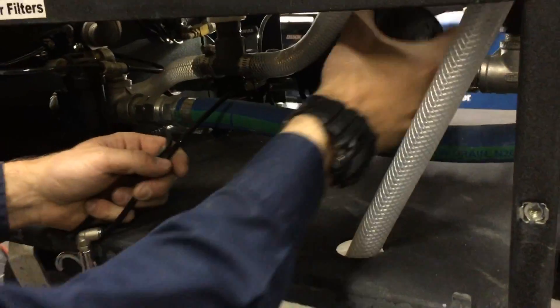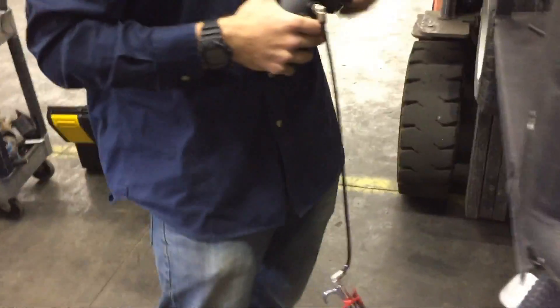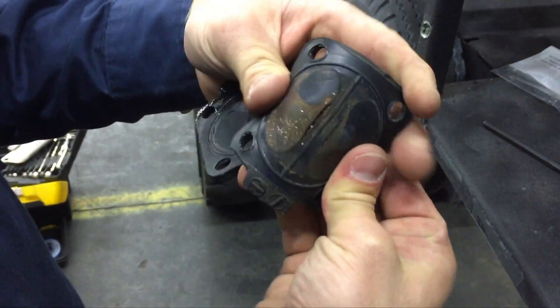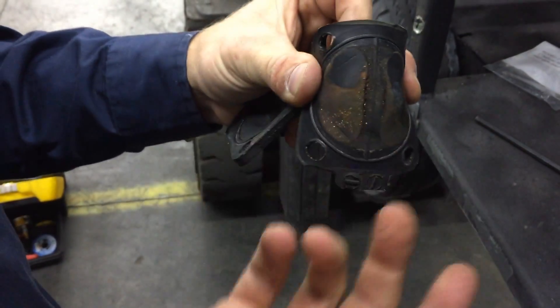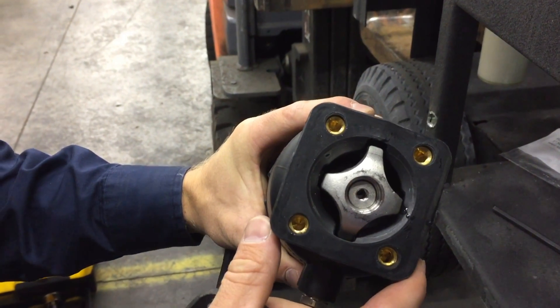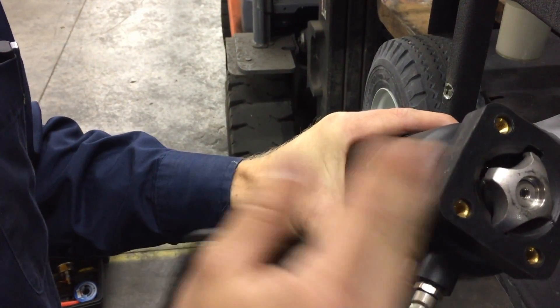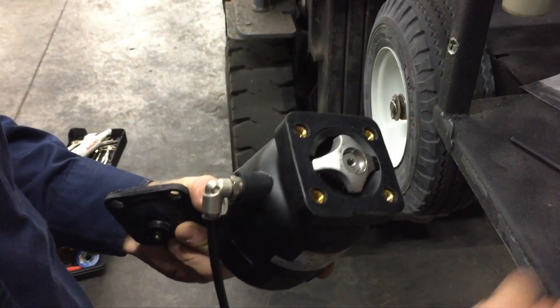Take this around and pull it out. What you're going to find is your old diaphragm will have begun to wear — look for cracking of the diaphragm. This one did not go through all the way, which is ideal; you do not want that to happen. If it did happen, make sure you clean out the valve itself — get all the grit, media, and debris out of there and dry it out as best you can with shop air, so you do not wear the seals of that piston.